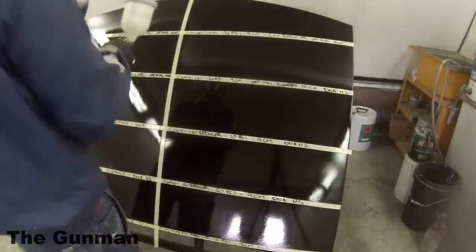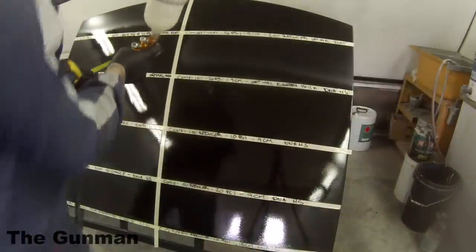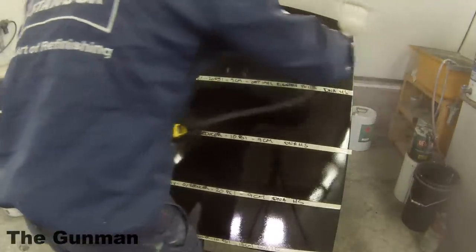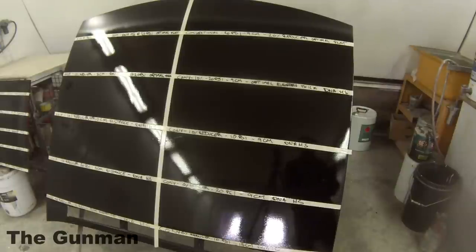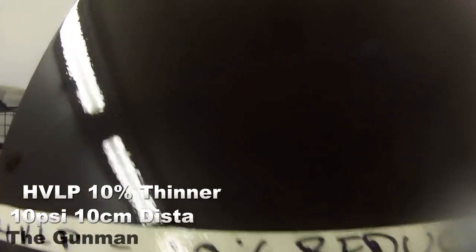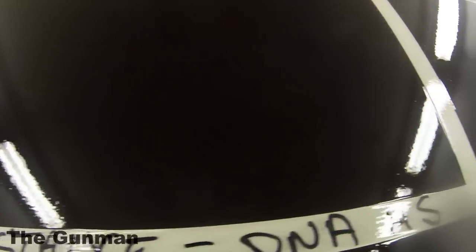I may do another video on overlap as well. Unfortunately I forgot to press record on my camera for the next two HVLP tests, but right here is the optimal setting for European finishes using the conventional spray gun: full fan, fluid at four turns out, 10% reducer, six centimeter distance. For HVLP at 10% reducer, 10 centimeters at 10 psi is still a little orange peely. Bringing the gun closer and getting pressure up to 20 psi gives the optimal European finish setting.